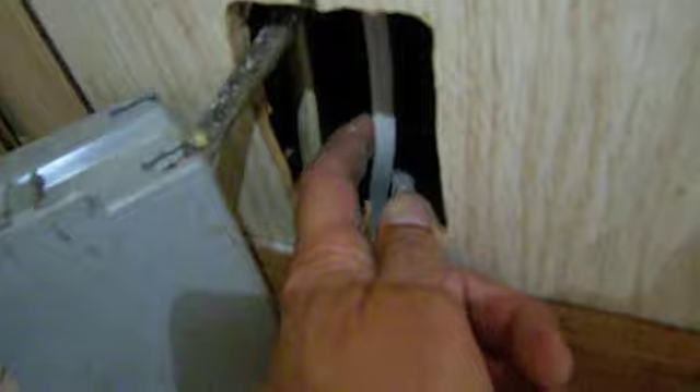This is working out really well. That box — I don't know where that wire went. So I have fished a new wire down through the panel. It goes down the wall, goes through the wall here. You're not going to get me again. There's the new one — runs down, and there was a hole down there where another wire went through, so it's already into the house. All I've got to do yet is crawl under the house, staple it up, mount the box, put the receptacle in, and done. Easy, just like it should be.